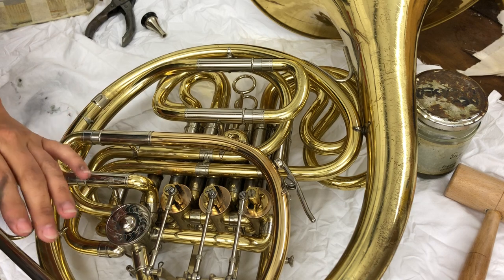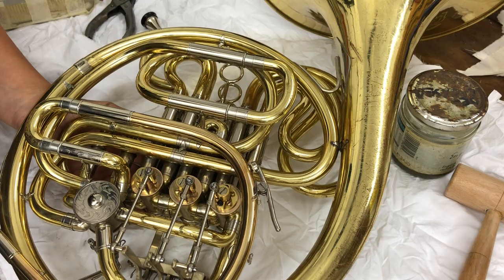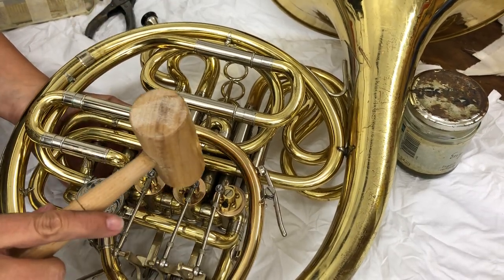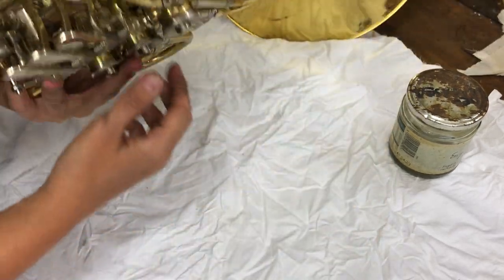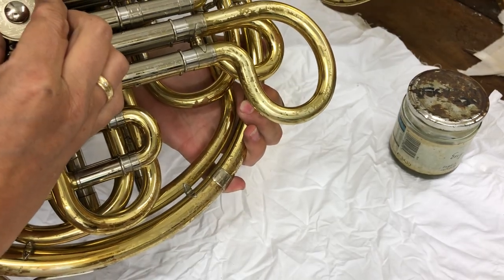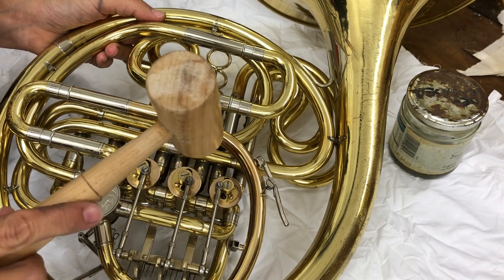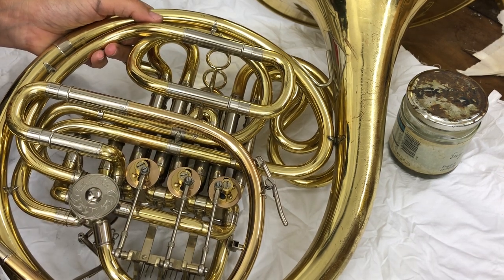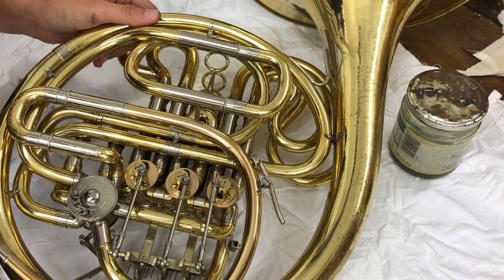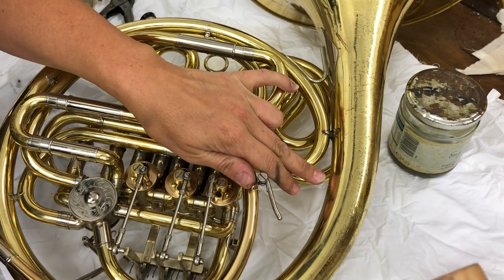If this is not working and your valve is very stuck, a small tap onto this collar after you've loosened the top cap — a short tap on here. If you don't have a wooden mallet you can use a spoon, a wooden spoon. Be very careful of the tubing around here; you might want to protect it while you give it a tap.